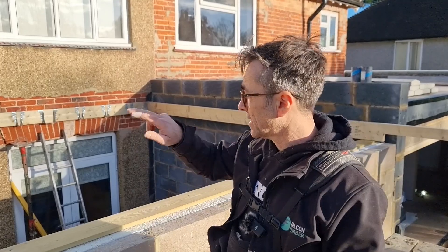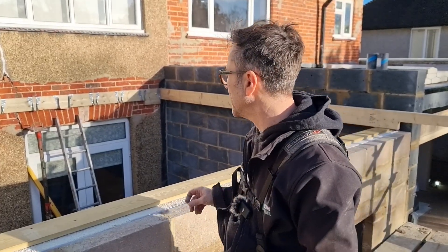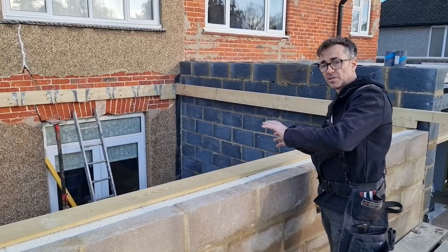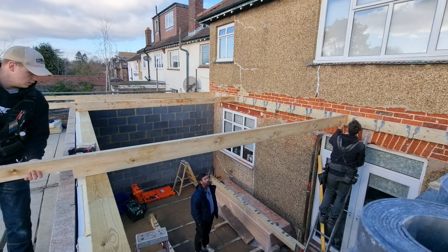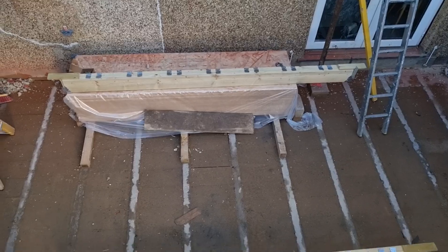So we've bolted the plate on the wall. We used a 16mm sleeve anchor to bolt it back into solid brick — we find where the bricks are and go to the top course and the bottom course behind the pole plate. All the hangers are on exactly where we want them. We've got a triple either side of the big trimmed opening, and we'll put the inside one on each side of the opening. Then we've got our trimming beams down there, which have already got the hangers on, corresponding with the hangers on the wall plate.